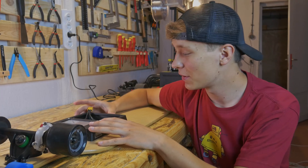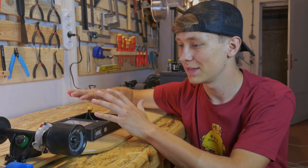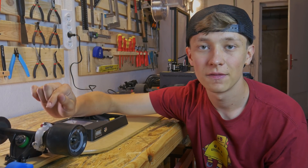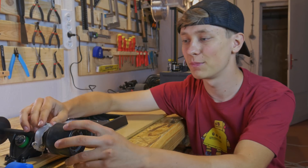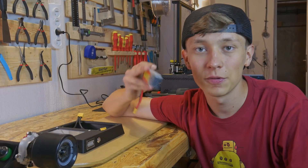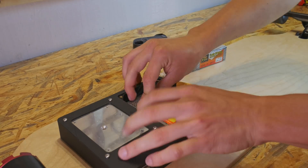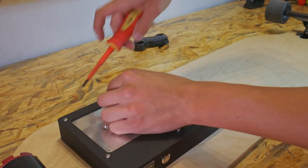I'm really happy with this box — it's small and compact, and pretty easy to fit everything inside. I just need to add the batteries. This clamp is 3D printed with PETG filament, 100% infill and 4 perimeters. I hope that will be strong enough — so far it's really strong. I also tightened the belt, so it should be fine. Let's put in the batteries and go out to test it!